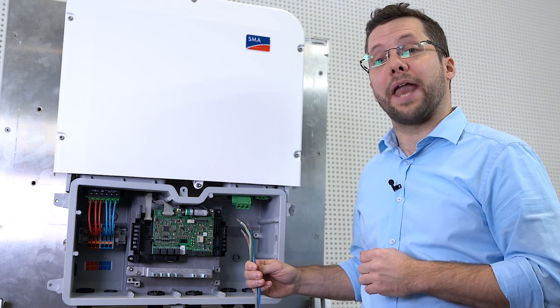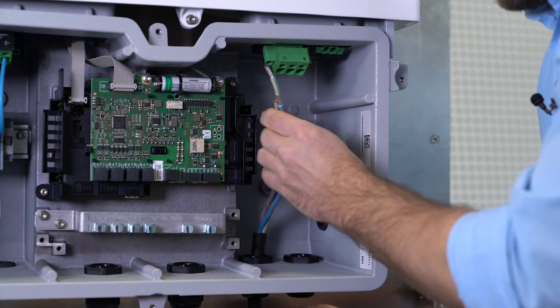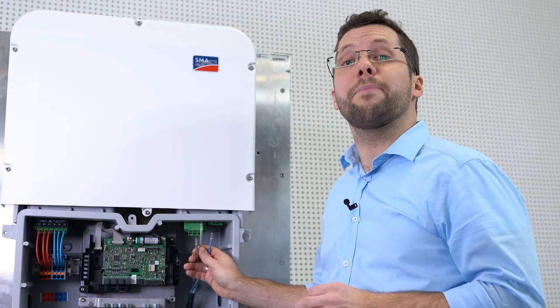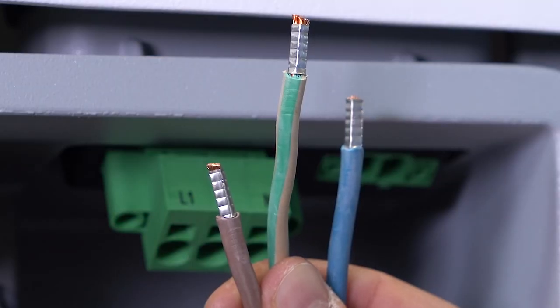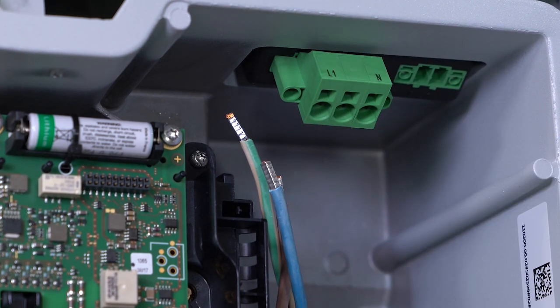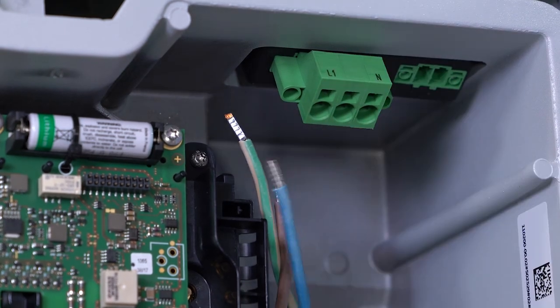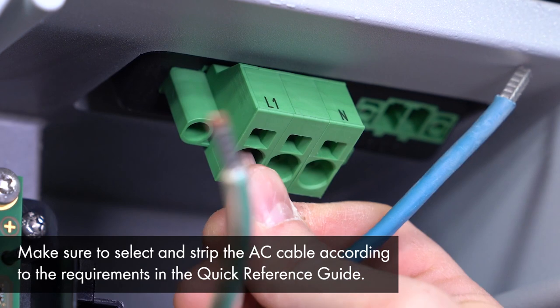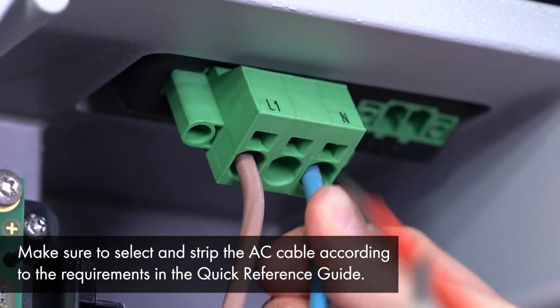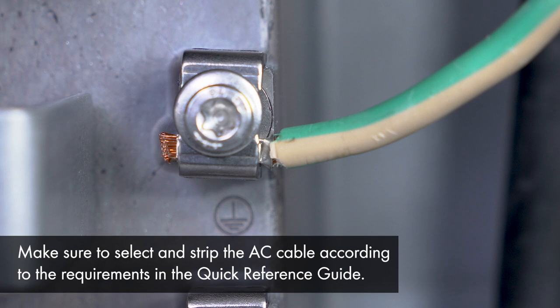Now I am going to insert the AC cable into the cable gland. The AC cables need to be stripped so they can be correctly inserted into the AC terminals. As you can see we have already prepared this for you. The next step is easier if you connect the AC plug to the inverter first. It should then be tightened with a 3.5 millimeter flat head screwdriver. Now connect the two AC cables — phase and neutral — to the AC plug. The grounding cable must be connected separately to an equipment grounding terminal between the washer and the clamping bracket. Then tighten the screw with a torque screwdriver TX25.